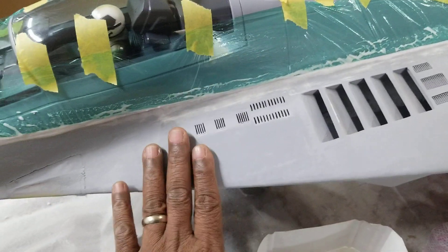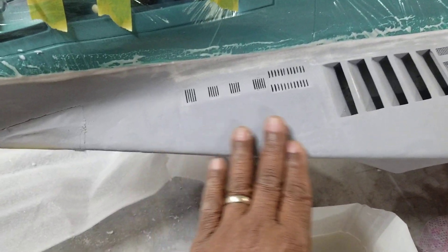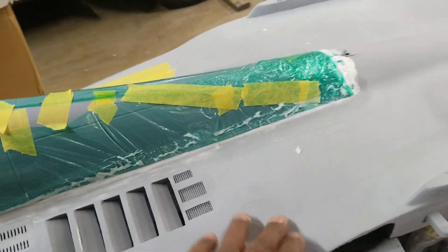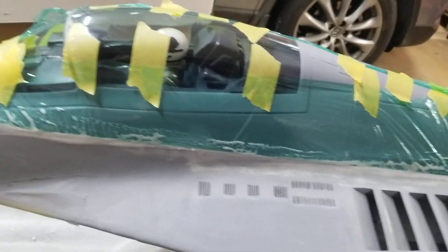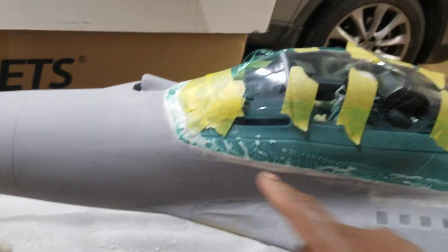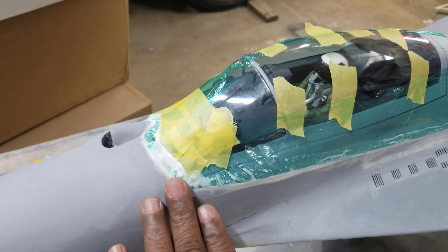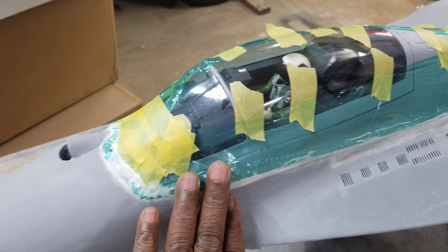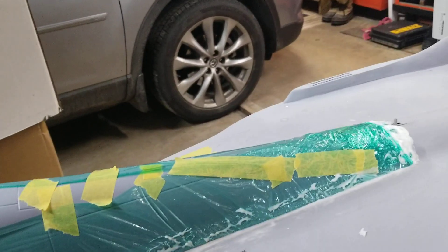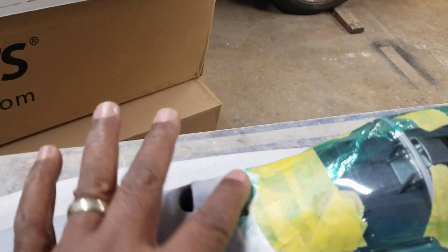I'm in the process of wet sanding. The only smooth part is right here, because you can tell the difference. I've got a lot of wet sanding to do. What's taking so long now is I'm trying to get rid of this seam. When you guys have your canopy, or when you see other guys' canopy, when they meet here, there's a gap, and I don't like it. So I'm going to fill it, sand it, try and take that down so it's real thin and it looks nice and tight. I had a little gap up here around the nose, and that's why this is getting filled in.